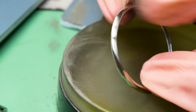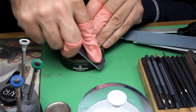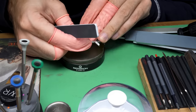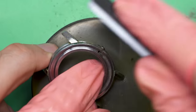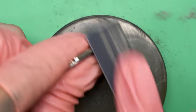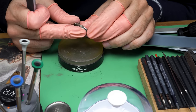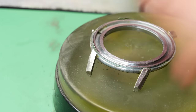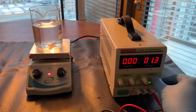The key with plating is prep — you absolutely have to get the case exactly how you want it to look before electroplating. The process will not hide anything; it will not cover up scratches or dings. This case isn't going to be perfect no matter what, but we want it looking way better, and in order to do so I need to get it polished and looking basically how I expect it to look when it's done.